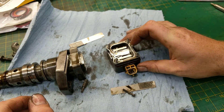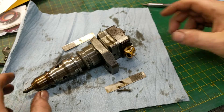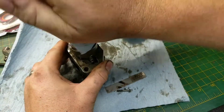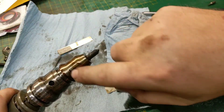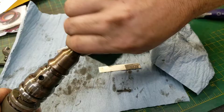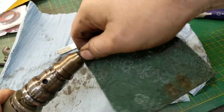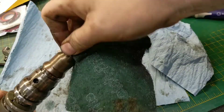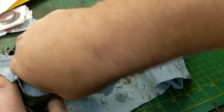Now that clearances are right, put it back together. On to the fun part — cleaning up. Take a rag and wipe off all the goo. Use a little scotch-brite to clean up the tip, and clean up the reservoir a bit too. Clean this tip well because the copper ring seal has to seal down here, so you want to press down and clean that seat. Just a quick scotch-brite rub, clean up all the oil — get her cleaned up.